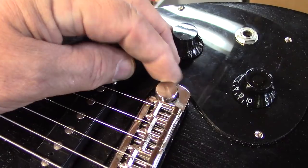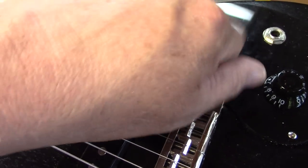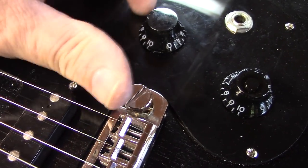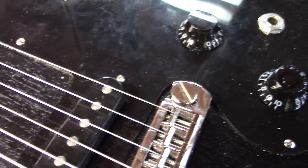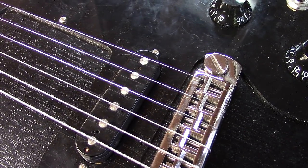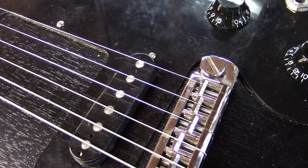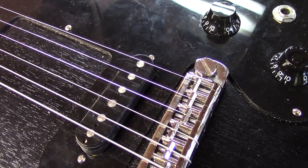So first of all, you can see that the head of that lug is an independent piece. So that just threads into the shaft. Now what's nice about this, if you think about that other video, I had gone to all that trouble on the original bridge to make up a couple of shims to get a good solid press fit. With this bridge, none of that is necessary.